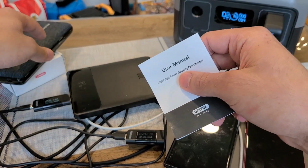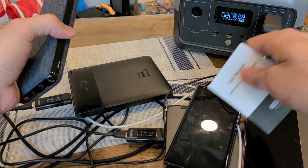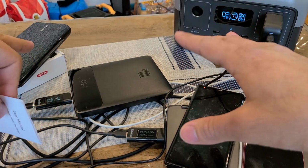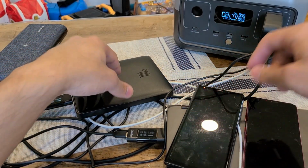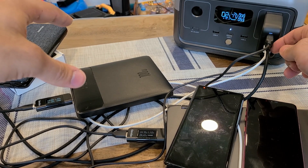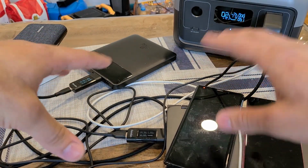And so yeah, once again, that hiccup with the Accentrus power bank is something that happens with other 100-watt wall chargers that I've reviewed. I wouldn't blame that on the wall charger specifically, but yeah, it's still an anomaly to me, but that's just what happens. And also, one more test I believe I need to do is I'm going to charge the Accentrus power bank and the Basis power bank at the same time from C1 and C2 to see if I'm actually able to use the full 65 watts from C1 and the full 30 watts from C2, because we weren't able to see that before. But yeah, let me just get everything disconnected and test that out. I'll be right back. Let me just get this all cleaned up real quick.